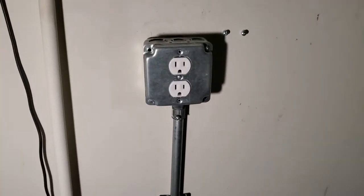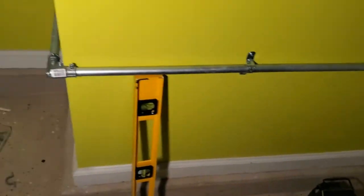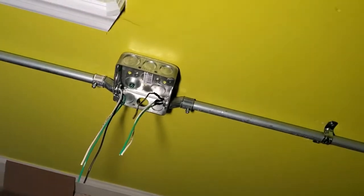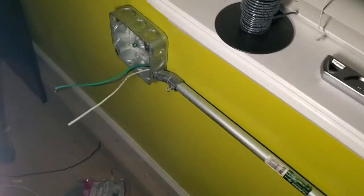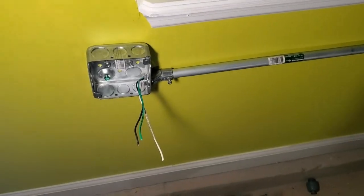Here we are, we have this socket all buttoned up, ready to go. We've run our conduit down here and attached it into studs in the wall. Along this way we've run it through, continuing to attach it to studs. Ran it through here, so I need to wire this box here. I went ahead and cut my conduit and some more wire and ran it down to my final box here - this is where it's going to end. I'm going to wire these up and then continue from there.